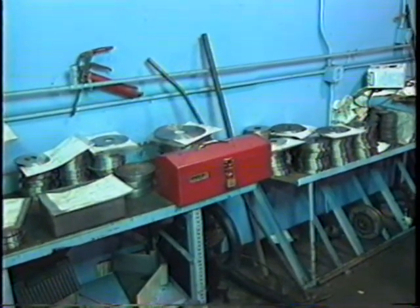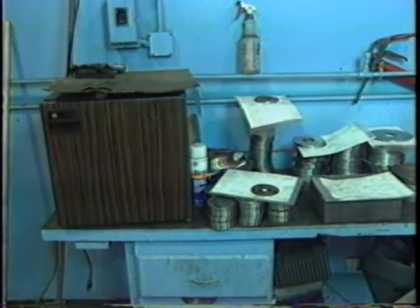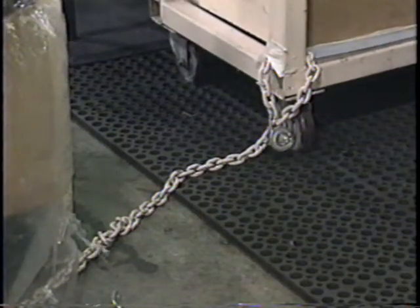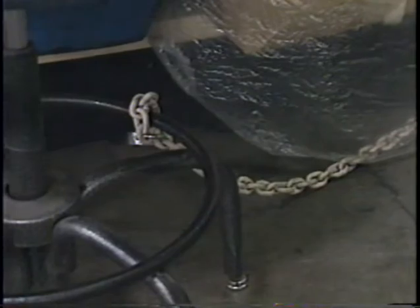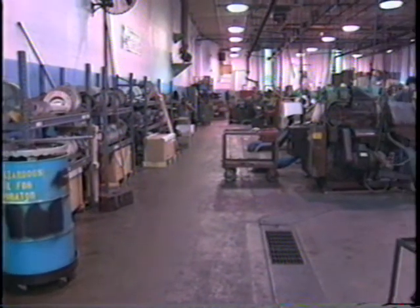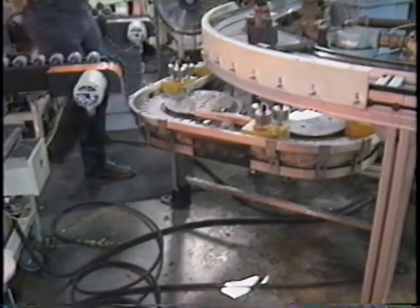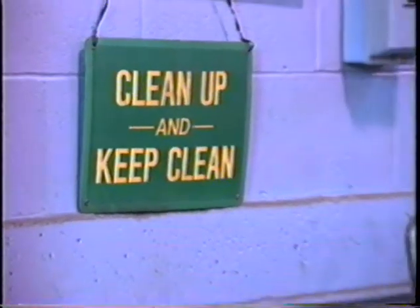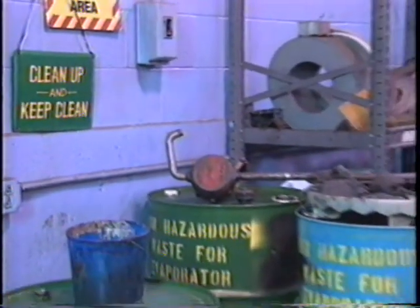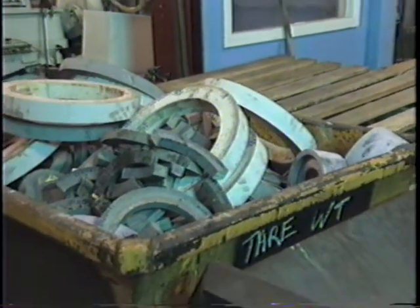Most factories have some amount of disorderliness, and most people who work there are so used to it that they don't notice. For example, when aisleways are not well defined, they can be dangerous. Items will be left where people can trip over them, and carts and forklifts can run into items, equipment, or people. Poorly managed equipment with wires and hoses can also be dangerous, as can chemicals stored in a disorderly or haphazard way, or scrap handled or stored improperly.